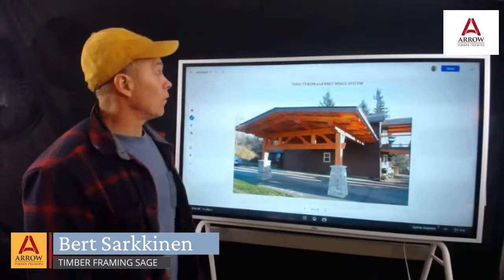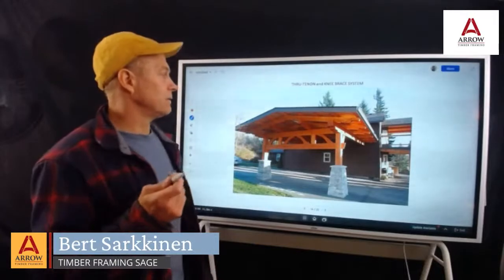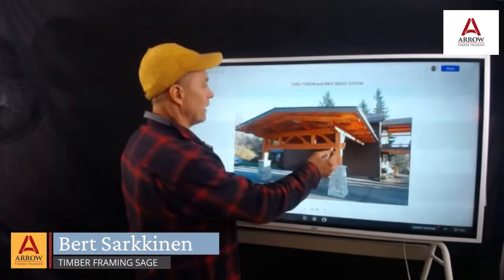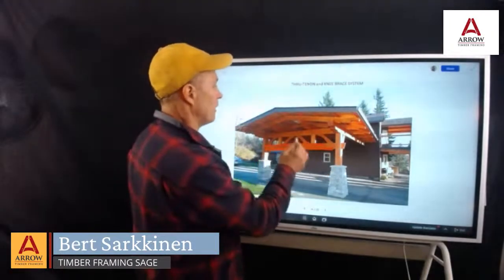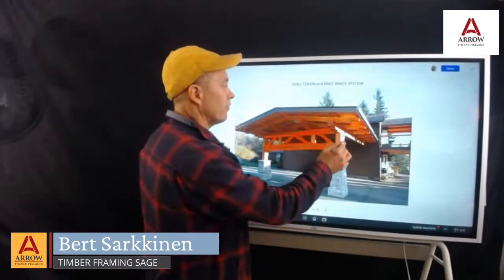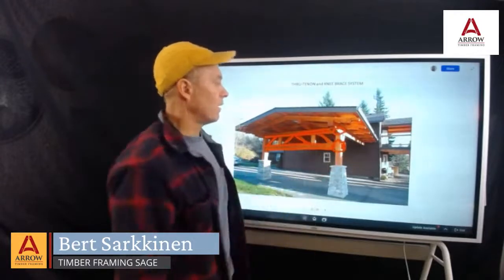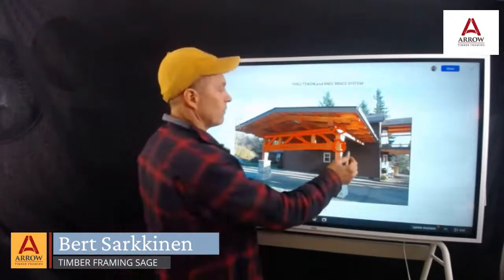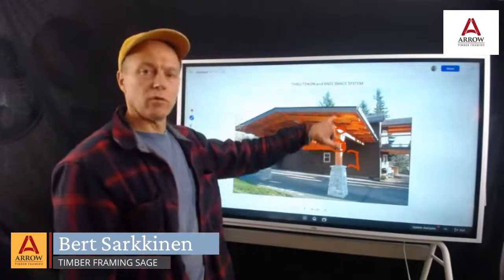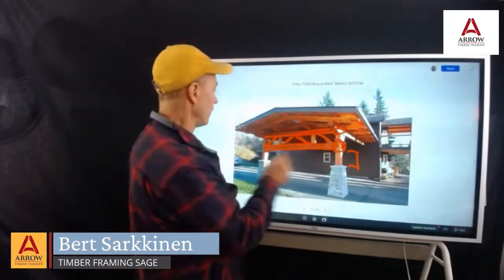Through tenon. Okay. You'll see this in tables, furniture, and it's like a knee brace, except that you've got basically a box beam that has the lateral braces built into it, and then this through tenon coming through. And we get connection here and here on that box beam. And now it's just a matter of how much the post will flex and what kind of tension those joints will take here. And you can see the pegs are right smack in the middle of the post again.